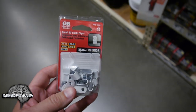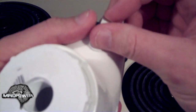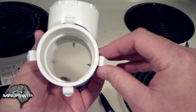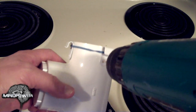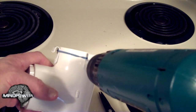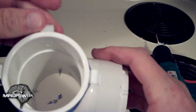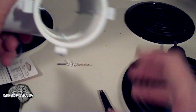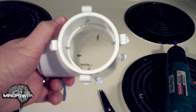Once the glue's dry, it's time to attach the easy clips. Start by doubling up a couple of rubber bands around one side of the T-joint, then insert your easy clips so they end up shaped like a cross or X across the end of the T. Once in position, drill the holes right through the easy clips — though marking the holes first and then removing the clips before drilling would be a safer approach. Once the holes are drilled, fasten the easy clips down with the screws and remove the rubber bands. Repeat this for the other side, so you'll have four clips with screws on each side of the T-joint.